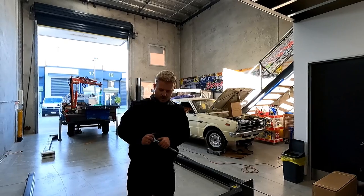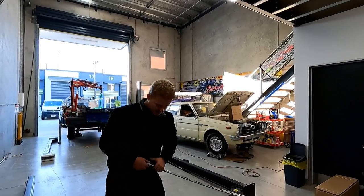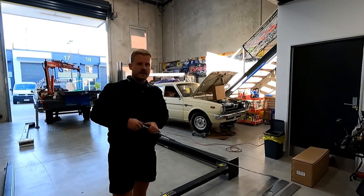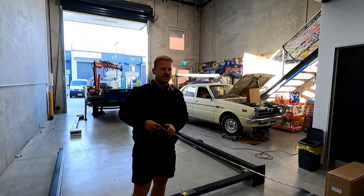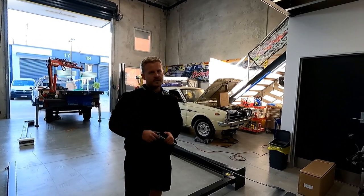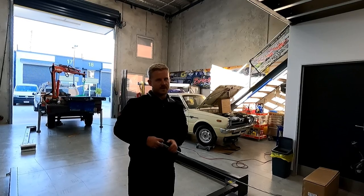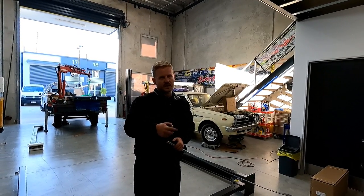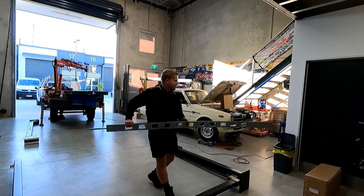So these are what your locks dive into to actually hold the hoist up. And they're doing that at all four corners. This lock has two safeties: the safeties that you control and then automatic safeties. The automatic safeties are on the cables, so if anything were to happen to the cables, they dive in and catch it. So yes, these hoists are very safe.